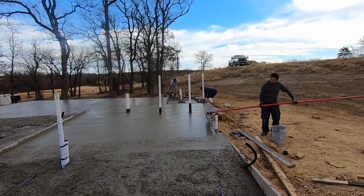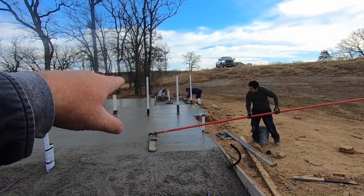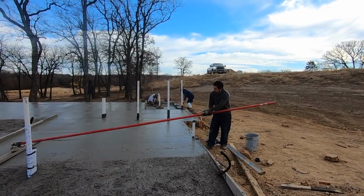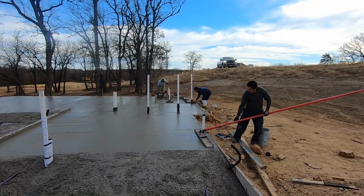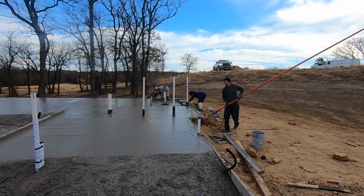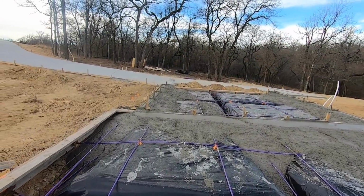Getting them mocked down or getting a little step down over there. Somebody asked the other day about these stakes, these wood. Those are step downs, probably for the shower and stuff over there. Those will get pulled out. Those won't stay in, obviously. As the concrete dries, they'll pull the stakes out, then it gets a little more stiffer, then they'll pull that 2x4 out around there.